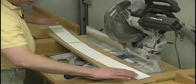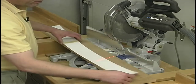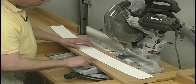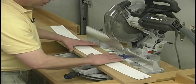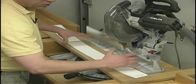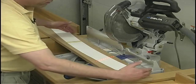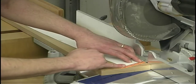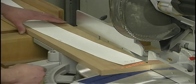After getting my stock squared up at the ends, cut a little bit long and ripped to about five and a half inches wide, I then took my template, laid it on my stock, traced around everything, and made notations as to where that flat area is, because that's somewhat of a critical dimension. Now at the compound miter saw, we'll cut off our overall length following the angles on our diagram. Up here at the top end, it works out to 21.9 degrees — or 111.9 minus 90 to get that angle. Then we'll do the same thing at the bottom end.